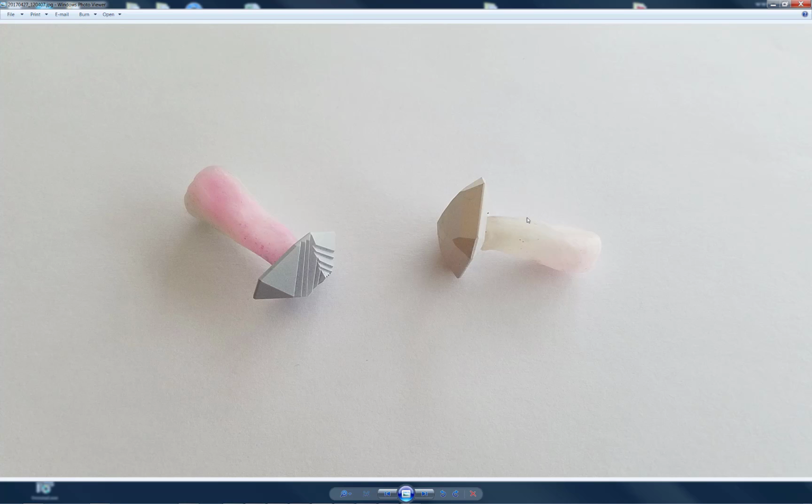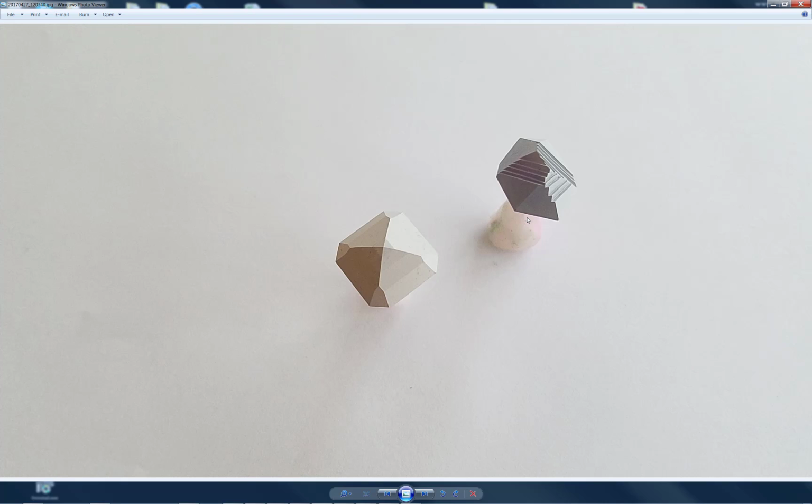Why we do this is, just think of this as a screen for a movie projector. If you're projecting a movie onto stucco, you're not going to get a sharp image. If you project it onto a nice smooth wall, it's a different thing. So by having a nicely prepared surface, you're allowing the structured light, which covers the surface, to be seen by the cameras. So that's basically the process.